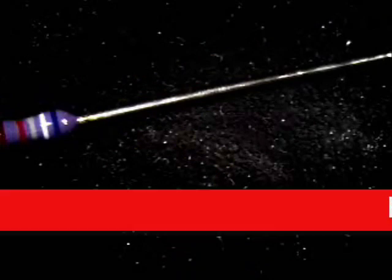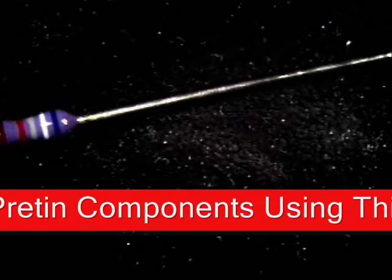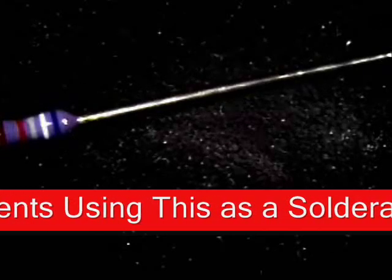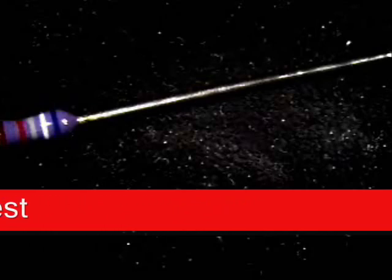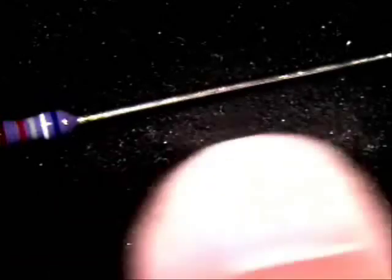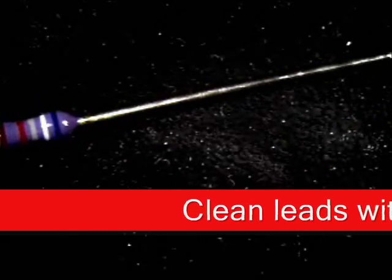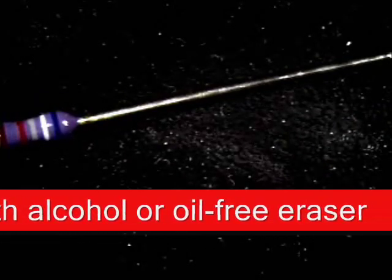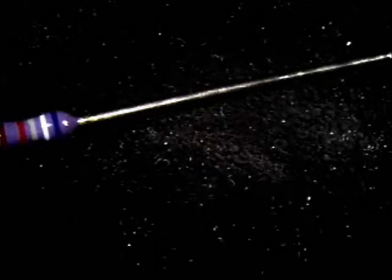Pre-tin your parts in lieu of a solderability test. I like to pre-tin my parts because I can guarantee that they're solderable at the beginning of the soldering process — that is the easiest way to test for them. If they're not solderable, you might want to clean up the leads. You might use a non-abrasive oil-free eraser to clean the legs off, or use alcohol or something to clean the legs so they're easy to solder to.